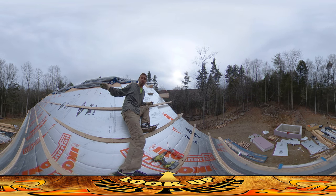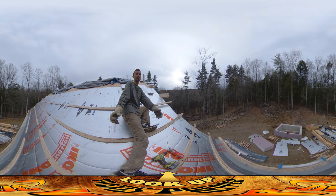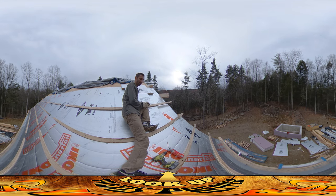We've got everything that we can do until we put in a few more ceiling boards up on the peak over there, because these things go up in four-foot increments and we're within four feet of the top. We've been working really hard today. Josh has been helping a lot — right now he's down in the lower level bringing more gravel in, compacting it, getting it ready for our floor slab. But every time I had things all set here, he would be running up whole sheets to me and I would be securing them in. So you're going to see me put in the last couple of them.